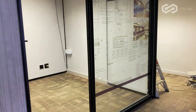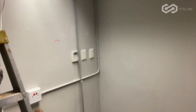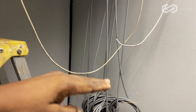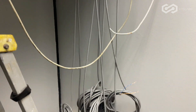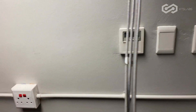All of that coming through into a point — they come in here, all of that coming through going to the ceiling and coming through here. They're all going to be here in the 48-port patch panel. I'm going to patch it, I'm going to have a 48-port switch here, and then from the patch panel to the switches, and then uplink to the main distribution facility — the MDF.